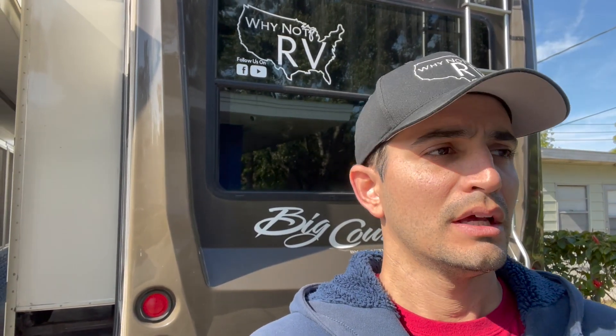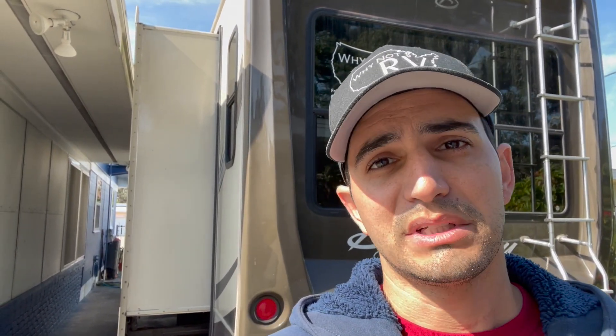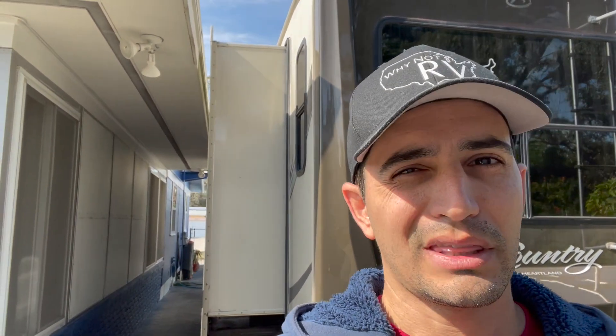The amp hours is the best way to know what you're going to be able to run and for how long. Once you have your amp hours figured out and you know how many amp hours you have in your battery bank, the next thing is to figure out what is usable out of that, because you have multiple different types of batteries — lead acid, AGM, gel, lithium. Lead acid batteries are only supposed to be taken down to 50% capacity. So even if you have a 100 amp hour lead acid battery, that's only 50 amp hours you can actually use.